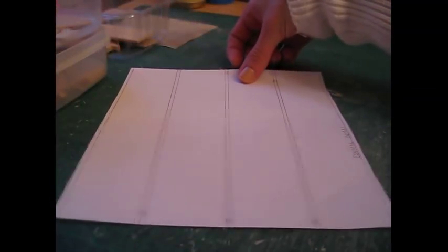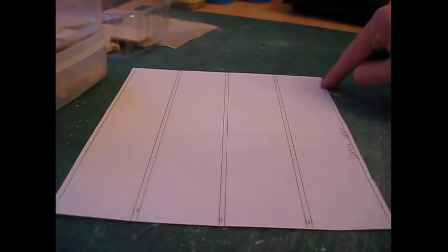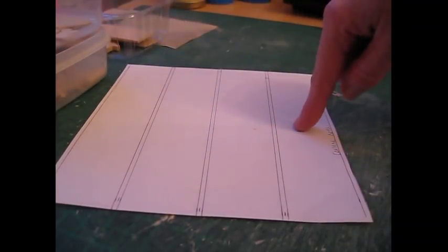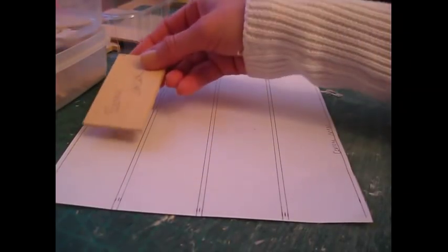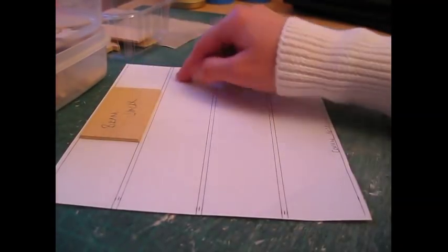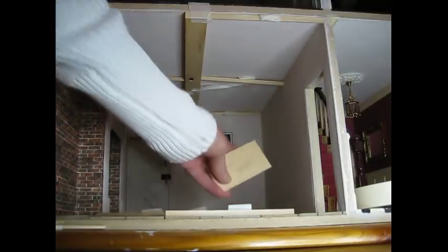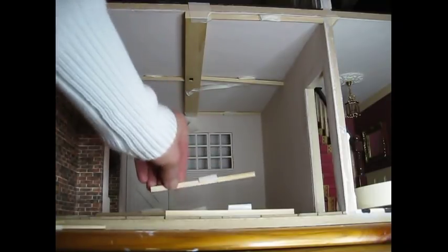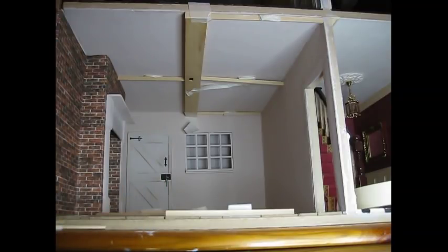I've made a template of a quarter of the ceiling. That central beam has enabled me to divide out the remaining beams with equal gaps between each. Using 3mm sheet wood I've cut some spacers — I'll put the back beam in place, then put the spacer there and do the next beam, and so on. I've cut all the beams needed for the right-hand side. I'll use the spacer to come along and put the beams into place with masking tape, but my head keeps getting in the way of the camera so I'll just do it and show you the result.